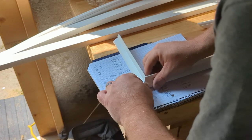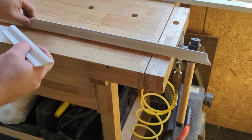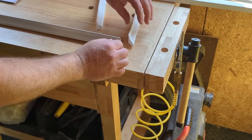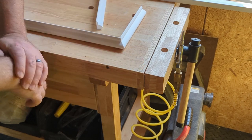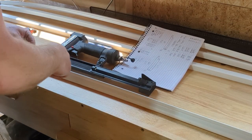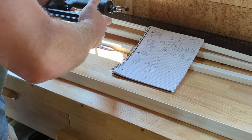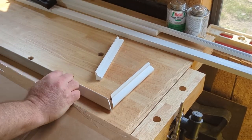Okay, so this is exactly what I'm talking about. Because of that mitered cut at 45 degrees, you're going to have a larger measurement from the outside than you would on the inside of that 45 degrees, which means the box itself needs to fit within the inside of that 45 degree cut. Because the boxes are sitting on brick, and I wanted that outside trim to be right up against the edge of the brick. If I had measured this with the actual box itself, then this trim would be overhanging that brick, and I did not think that would look nice.